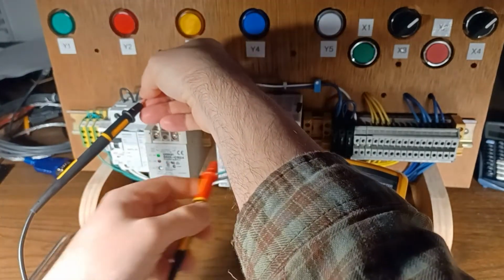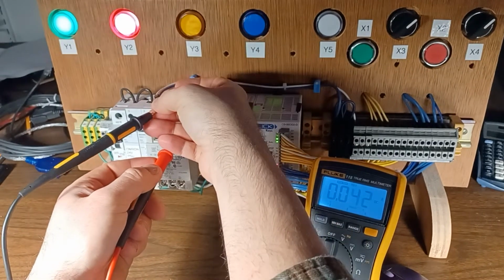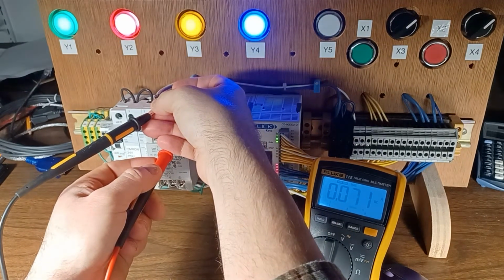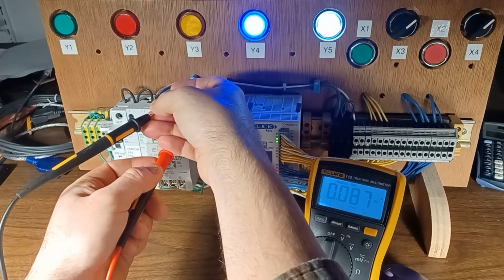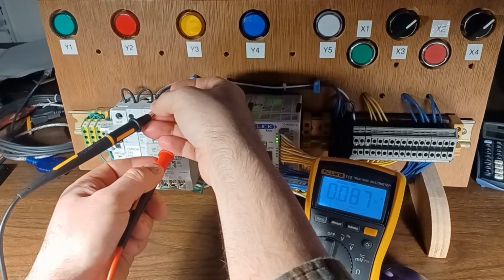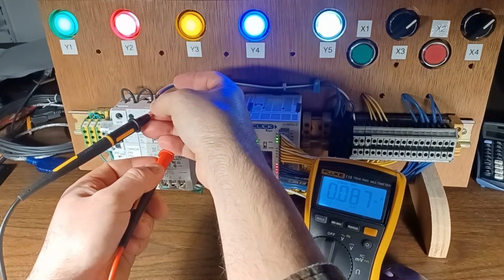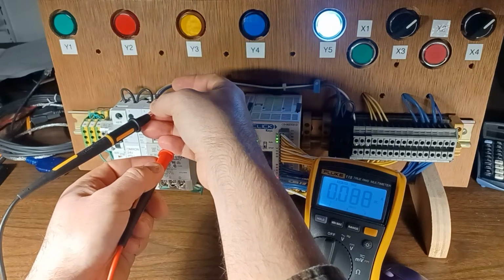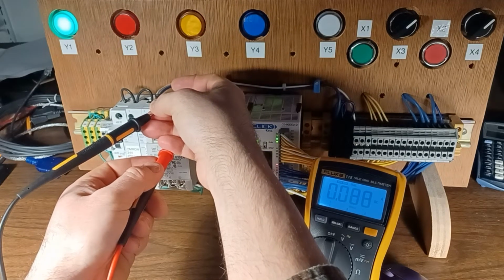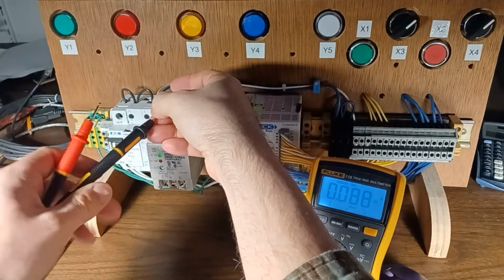So this power supply feeds the indicators and the switches, you know, the field device power supply, so to speak. I'll let that cycle again one more time, but these indicators are rated about 20 milliamp a piece, and we're getting, yeah, close to 100 milliamp, so that makes sense. The only other thing on there are the switches, so that's good.